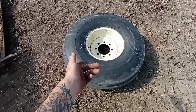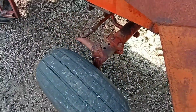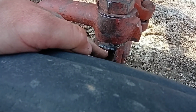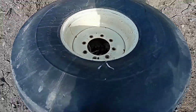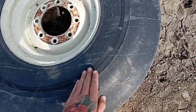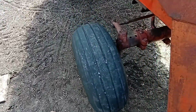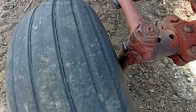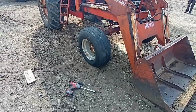And the dish on them is perfect, because when we threw this one from our old white tractor, this one's so big and the rim doesn't have quite as much dish as the stock wheel did. So what ended up happening is it was rubbing this stop here, as you can see where it's shiny on the inside of the wheel. And like I said in the last video, we only had 4 or 5K to make it home. So it ended up wearing a bit into the tire, not a ton, but either way it wasn't working. So these new wheels, we got room for days here. Shouldn't have a problem anymore with that. Like I said, a little bit of cracking, but they should be fine. And they look a hell of a lot better than those old ones.